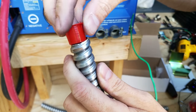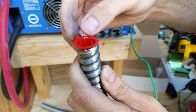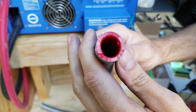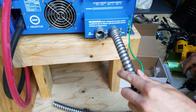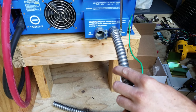So next I have my two half-inch pieces of conduit. With this flex conduit, you definitely want to use these plastic insulators — they go in like so. So your cut end is insulated, then you insert it into the fitting and just tighten down the set screw. It's as easy as that.